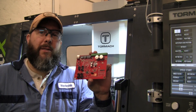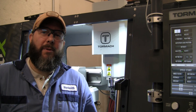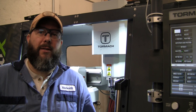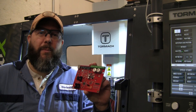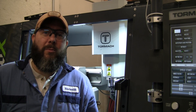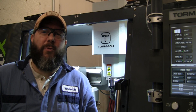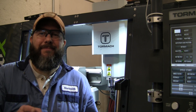That's a wrap on another video here in the Blades to Be shop. We swapped out the red board, got the green board in place — everything went really smooth except catching the tool tray back up to where it left off. Thankfully nothing broke. Hopefully this will help you if you need to make the swap. If you have one of these red boards, you may want to open your cover, look inside, and just expect this error to catch up with you at some point. If it's late on a Sunday and you can't get a hold of Tormach, hopefully you found this video. If you like the video hit like, if you like the channel please subscribe, and till next time — hope you're out in your own shop working on some fun projects. Take care.